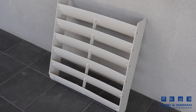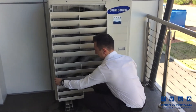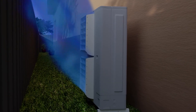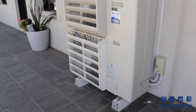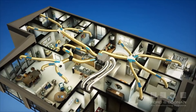That's why Ford and Doonan developed these air guiders. Air guiders are installed on the outside of the condenser unit and are designed to encourage the discharged hot air to be directed upwards and over the boundary fence. As the air is now directed away from the air conditioning unit, the system can breathe clean, fresh air that's lower in temperature. The closer this temperature is to the set point temperature inside the home, the more efficient the air conditioner will operate.